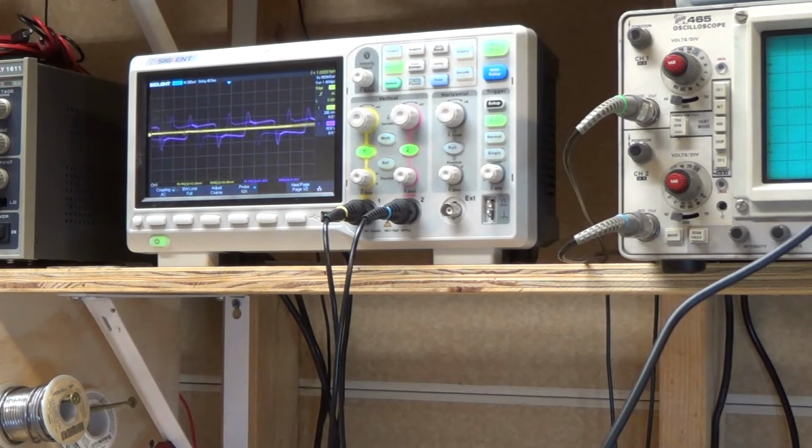The truth of the matter is I was really thrown off course by that op amp that looked like it was bad, and it was really just the grounds going to the gain, to the feedback circuit on the op amp, and the grounding for the bass that was part of the feedback for one of those final op amps.